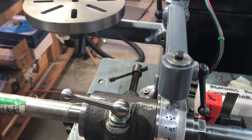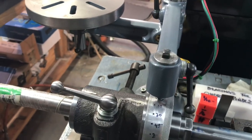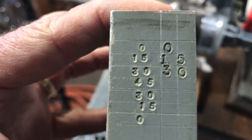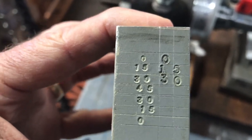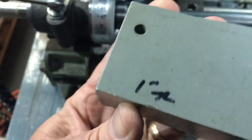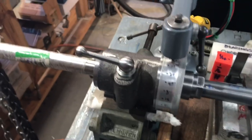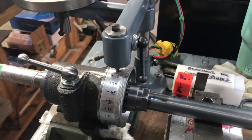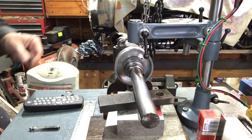With only two digits, it would be a lot easier to make the marks. I mentioned I had bought a set of 1/16-inch stamping tools — I tried them out yesterday. The ones on the left are the 1/16-inch and the ones on the right are the 3/32-inch. I decided I'm going to go ahead and use the 3/32-inch tools here. I do think the 1/16-inch ones will come in very handy for the thimble on the base, which I still haven't marked. So that's my setup — I'll mark all the zeros first, then start marking the other intermediate measurements.